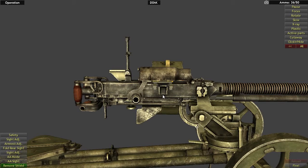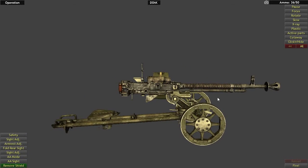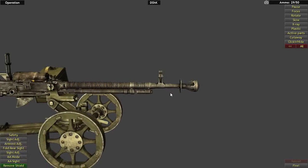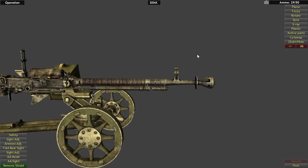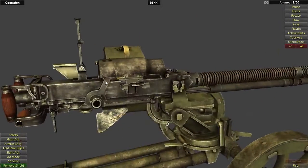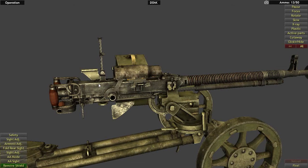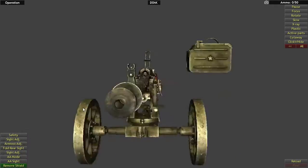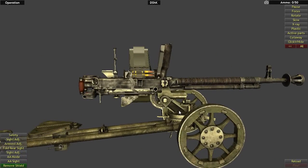Just after World War II, they decided to improve the DSHK, and what they came up with is called the DSHKM. They took away the original muzzle brake and added a different one. When you see these guns in movies and video games, 90% of the time you're going to be seeing the DSHKM. The revolving feed mechanism is no longer present — they improved the design by adding a standard feeding operation, much like the Browning M2, where you lift the top cover, feed in the belt, rack the gun twice, and you're ready to go. This eased production and increased reliability.